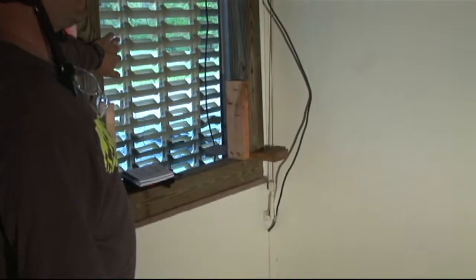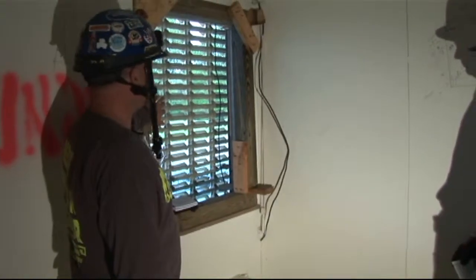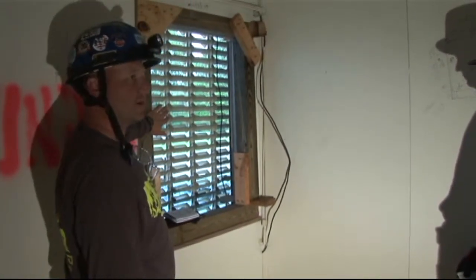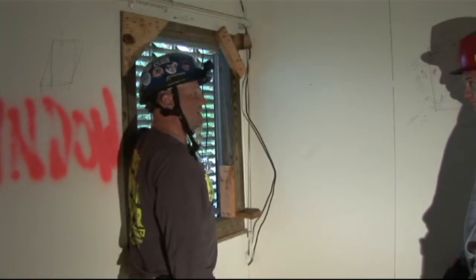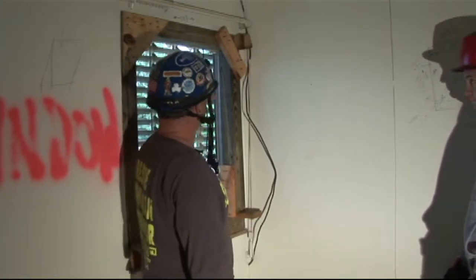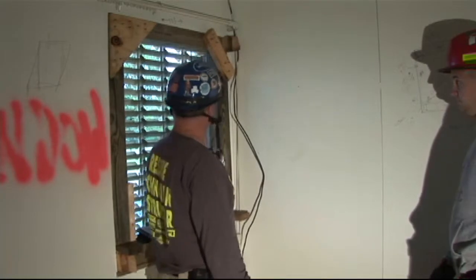Follow me on the pre-built. Any questions about the pre-built? We're going to build one in the next room in a second. Pre-built window shore — keep in mind, we can do the exact same thing on a door. You can do this cleating on one side if the other side is not accessible. If we can get to the other side, we're going to mirror image this cleating and gusseting on the other side — put a half gusset over here and our cleat over here.